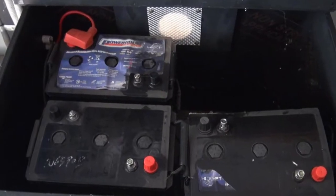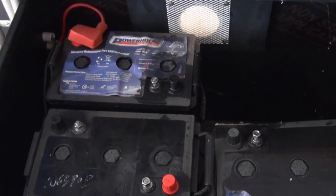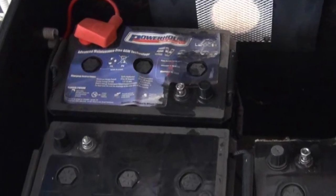This is simply going to happen with lead-acid batteries every now and then. Over time the crystals build up on the plates and they sulfate, and that just creates resistance — at that point they're going to drop really quickly. So if you've got an off-grid system and you're watching every night and the voltage is dropping rapidly, running out before morning, you've got to do something quickly or you're going to end up with no power.